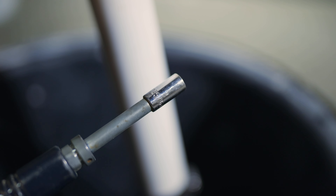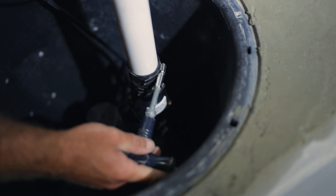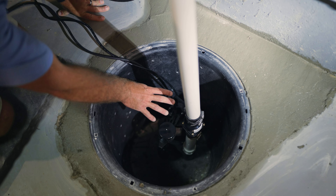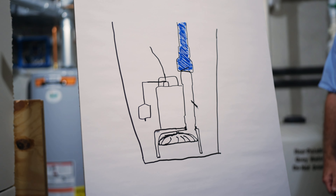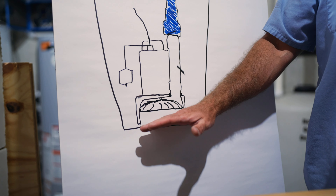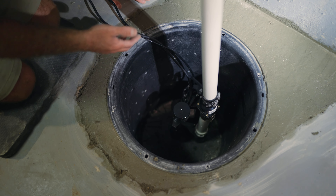This is a 5/16-inch torque wrench. If you don't have one, you can use a flat head screwdriver or a 5/16-inch socket — these just need to be really snug. This torque wrench is designed to break over at 60 inch-pounds, and I'm not even getting them that tight. One thing to note: we have our pump sitting off to the side a bit so that the float assembly is directly in the center of the pit. If the pump is set near the edge, the float assembly can get stuck against the side, preventing it from lifting or lowering. If it can't lift, the pump will never turn on. If it can't lower, the pump will never shut off and it'll burn itself up.